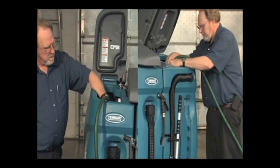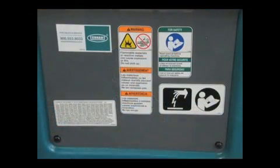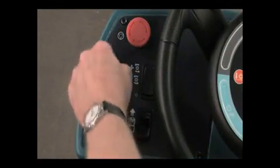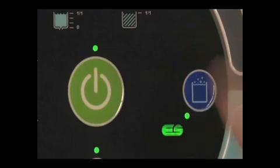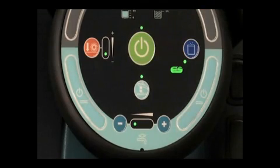The water temperature must not exceed 60 degrees centigrade or 140 degrees Fahrenheit. Fill the ES detergent tank with the recommended detergent and install the cap. Do not use flammable materials in the detergent tank. Next, turn on the key switch. Then press the ES switch to enable the technology. Next, press the large green one-step scrub button and start scrubbing.